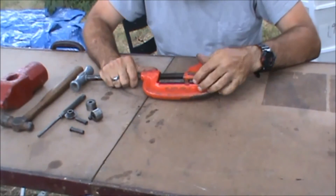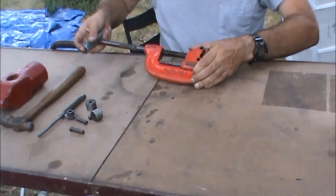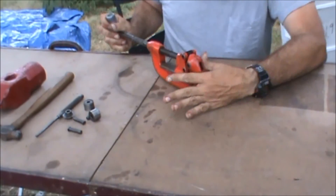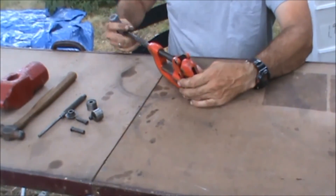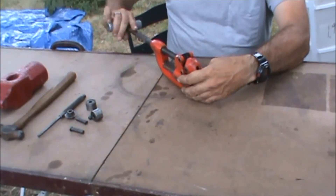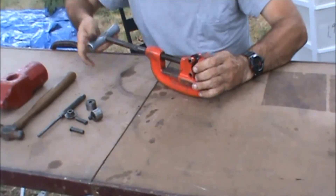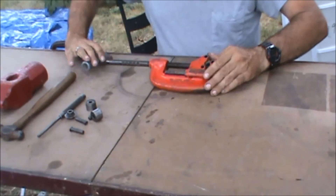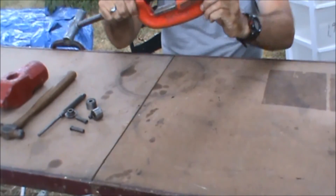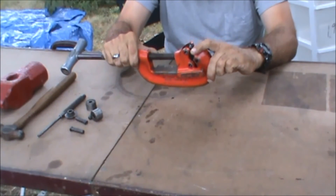At the same time, you want these jaws to go down over these little islands there. So it's slid back on. Now you want to back this out, and when you back this out, take your thumb and your finger and hold the front down. Start backing it out and kind of watch this a little bit — it should just walk back. If you don't hold the front down, what will happen is it will try and twist on there like that, and you'll get in a bind and it'll stop trying to pull back. It could literally break the thing.